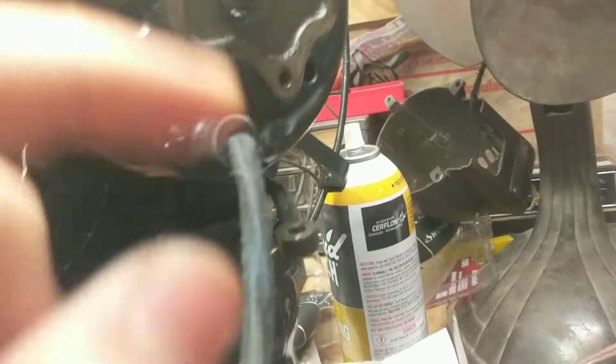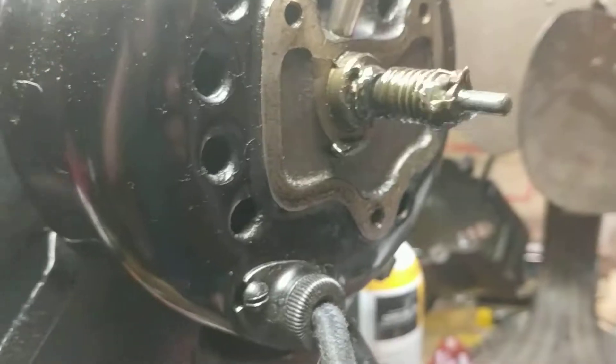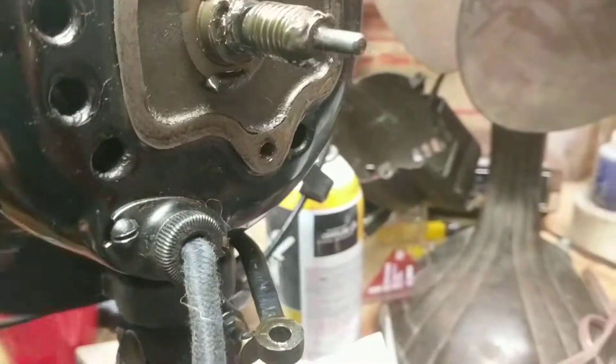I had to take off the oscillator. When you spin it, you want this part to spin also. There's a notch in there — when you take it apart you want to line up the notch with this. If it doesn't go in, take the gearbox off — it slides in and out. When you slide it in, you want it to lock in so that when you spin the blade, this spins too.